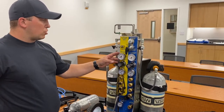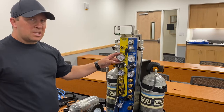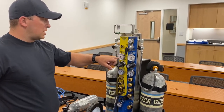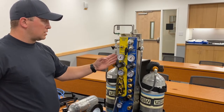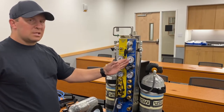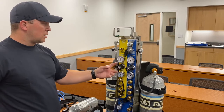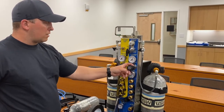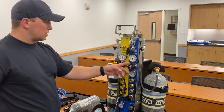The inlet pressure for personnel is 5,000 PSI maximum — here's the gauge for the inlet pressures. The inlet pressure maximum for the tool side is 5,500 PSI. There are pressure regulator knobs for both personnel and for high-pressure tools.